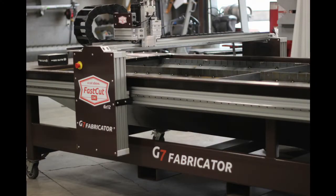There are 9 grease points on the table: one underneath the Z-axis bearing, 4 under the Y-axis on the gantry, and 2 on each X-axis tower.